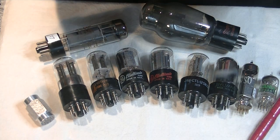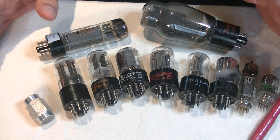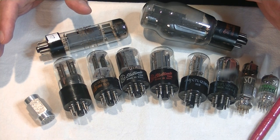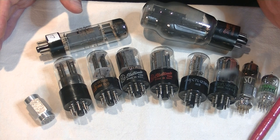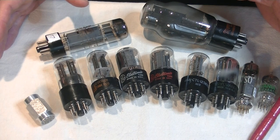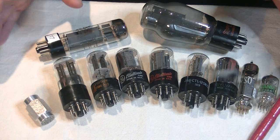After the tube is sealed, it's heated and the volatile metal flashes off, coating the adjacent surface and immediately absorbing stray gas molecules. So long as the coating remains, it is still able to absorb more gas. On older tubes, it's even possible to see the coating wearing away. Now let's take a look at a bunch of tubes, locate the getter, figure out what type it is, and describe it for identification purposes.